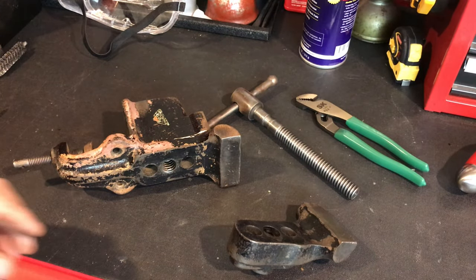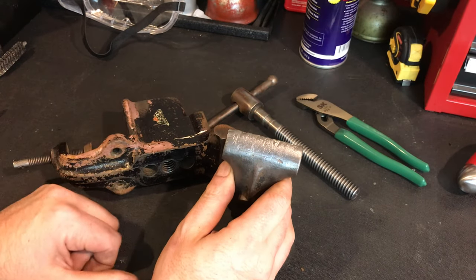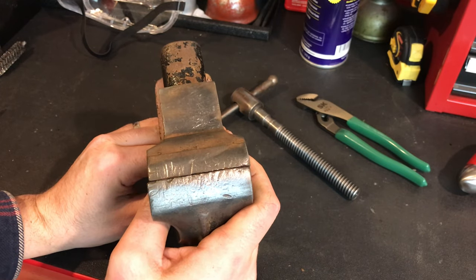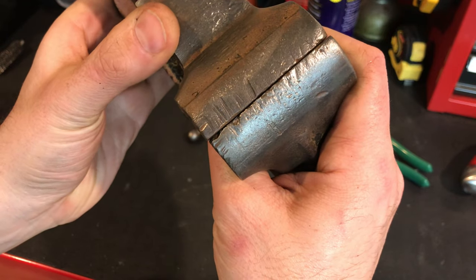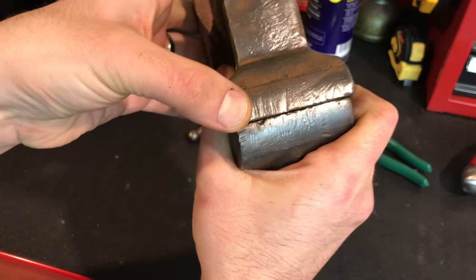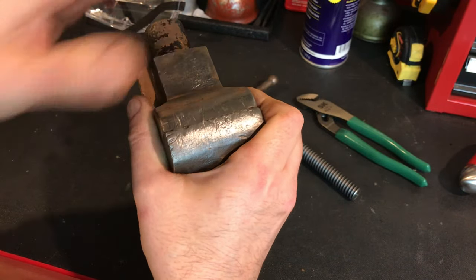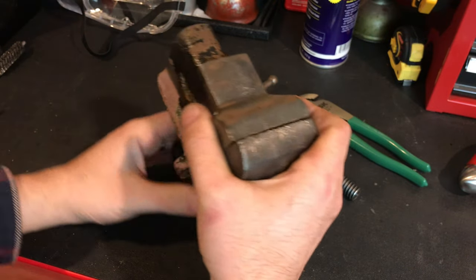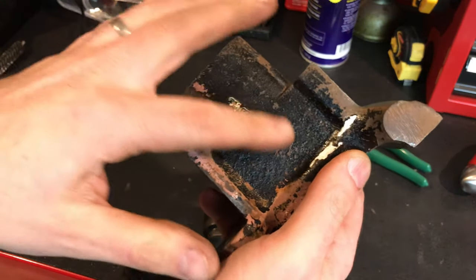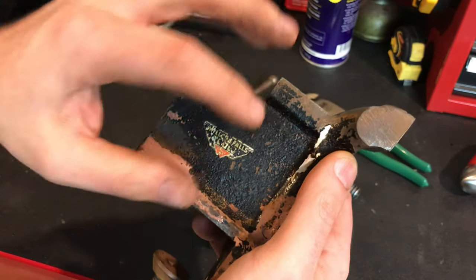I'm about to call it for tonight, but I just want to show you where I am at this point. I gave it a quick shot on the wire wheel just to kind of see what I was up against once I got under some of that old paint and patina. Normally that could be ground down, but you can see there are a couple of spots that are pretty deep. I think what I'm going to do is drop a little JB Weld in there, and then once I hit this with the flap disc I should be able to grind that all down. I kind of like the casting on it — it looks like it was pretty nicely finished. If I just hit that with a pretty stiff wire wheel, it'll leave a nice finish when I paint it.